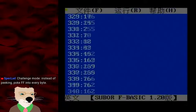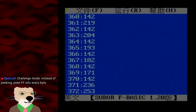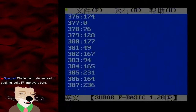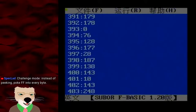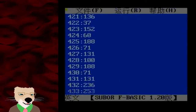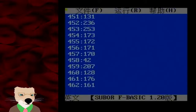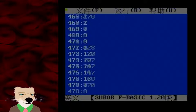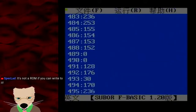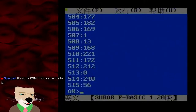No, but it has that RAM, so maybe it's just... Yeah, well, so the thing is, it definitely has plenty of RAM mapped somewhere, but this is the entire memory space, so there's also ROM here too. It may not start at zero. Yeah, exactly. Well, so certainly the regular program space starts at hex 8000. So as interested as I am in getting a full memory dump, I can do that on my own time rather than wasting the stream's time doing that.